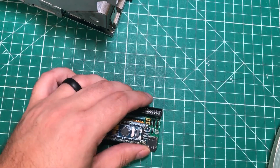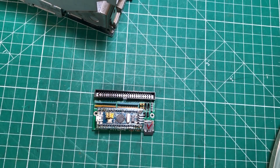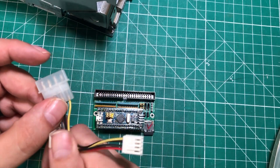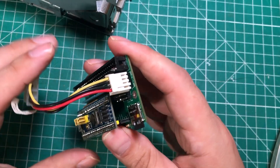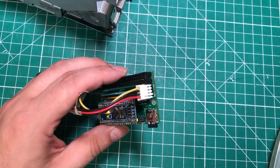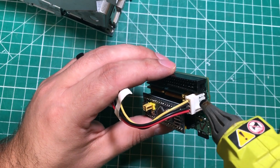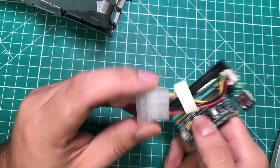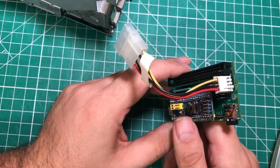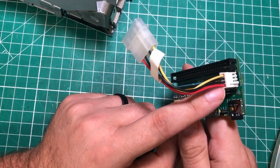You've got a lot to learn from old people. Once you get one of these things up and running and tested, go ahead and put a check mark on the SD card just so you know that one is good to go. The next thing is we're going to adapt this down to the standard 3.5-inch drive power connector. You want the red wire to go toward the SD card. Things go wrong sometimes — you get busy, you can get to plugging things in and out. So put a little bit of hot glue there, not enough that it'll never come off, but just enough to remind you to unplug it from this side and to make sure it never gets plugged in the wrong way. Because if you do it the other way, instead of putting five volts here you're putting 12 volts here, and you're going to kill the entire thing.